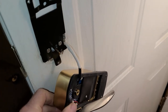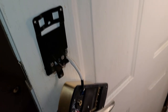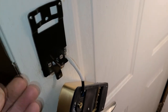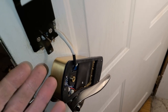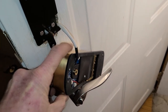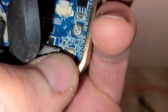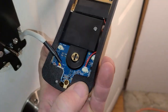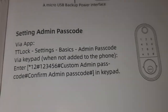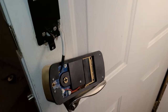I had a little bit of trouble pairing it with my app. Installation had a couple quirks and the directions are a little bit unclear, to be honest — they could have done a better job with the instruction manual. My phone was not picking up Bluetooth and wasn't allowing me to pair it. What worked for me: underneath the flap on the right-hand side, that little button is a reset button. Hold it down for about 10 seconds, then input the administrator password — either 000 pound, or star 12 pound then 123456 pound as shown in the instruction manual. After reset I was able to pair it to my phone.